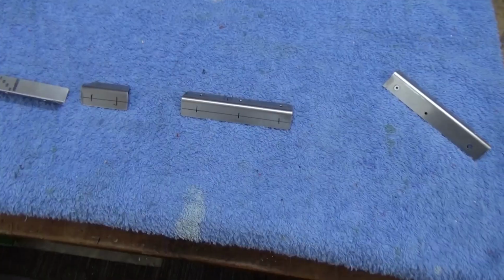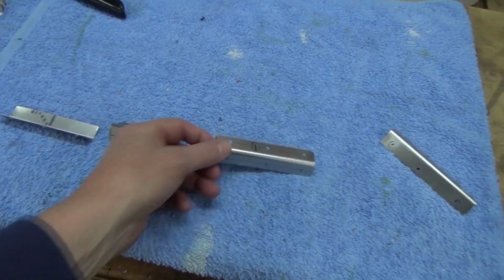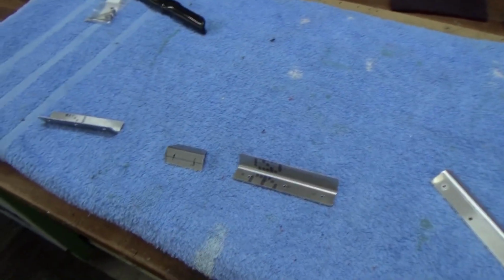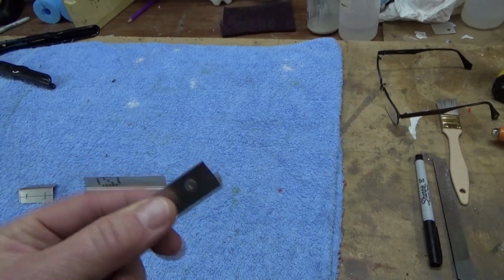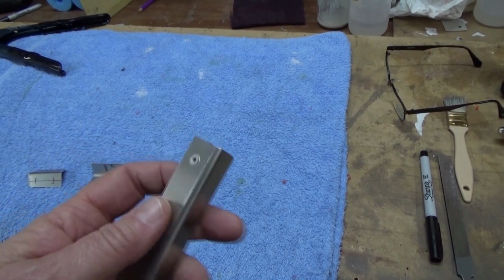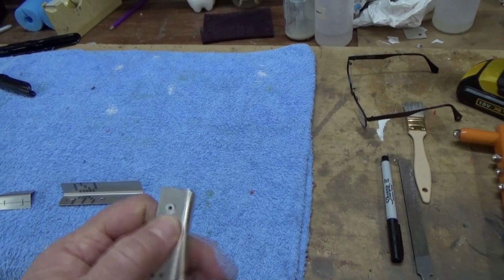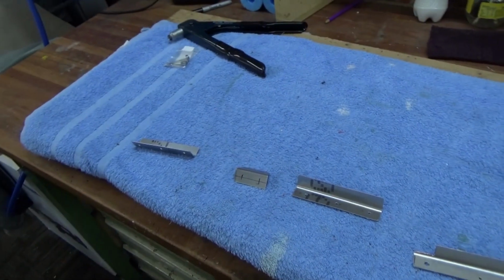Steering, but going well. And back on the rear pivot for the main control column, I just knocked up these L angles. They're going to go between the anchor nuts and between the bracket, just to hold the skin up against the cross member. I just practiced with the 3/32 dimple die, and I whacked a 1/8 rivet in there, and that's come up really well. So I'll go with the 1/8 rivets in the 3/32. The trick is to drill a 3/32 hole, dimple it, then upsize it to 1/8 or number 30, and then whack the A4 rivets in. And that's worked out well, because the problem I've got on the bottom skin, the panel will sit over these rivets, but it won't rattle.